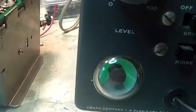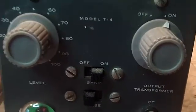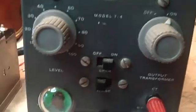Alright, we're all back together as far as the eye tube and heat shield. You can see it's all back together there. I don't see anything touching — I thought maybe the shield was touching something but I don't see anything. So maybe the cap was all that was bad. That was the only paper cap in there; the rest are disc caps.